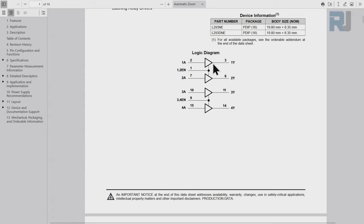We need the L293D motor driver, a DC motor, breadboard, and a few wires with our ESP32 module and camera extension board. Let's first insert the chip. This motor driver has a dot indicating pin 1, and pins go from 1 to 8 on one side and 9 to 16 on the other. Insert it with the red rail at the top, following the diagram.